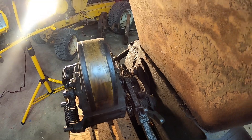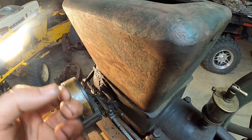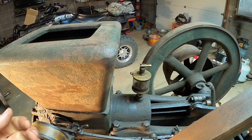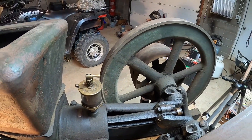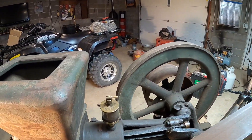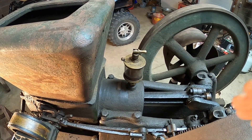That spark basically lit a fire inside our cylinder and created a bunch of pressure. All that pressure is now going to force our rod and piston back, and all the power from the rod and piston is transferred to your crankshaft, which makes everything turn. So now that we went through intake and compression, we're on the power stroke.